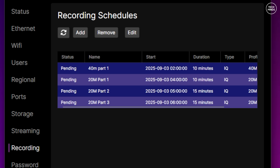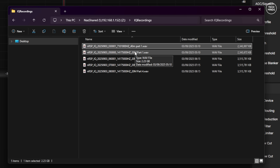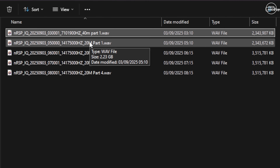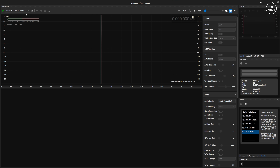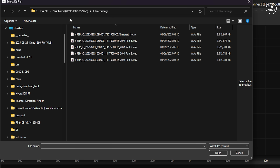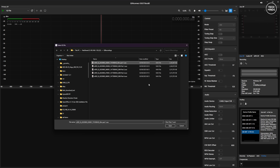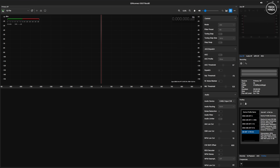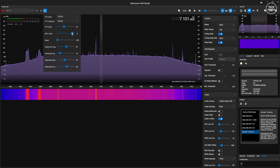Remembering I'll be turning off my computer — the only two devices left on are the nRSP receiver and the NAS. And here we are, navigating to the shared folder on my NAS from my Windows computer. We can see the IQ recordings made from those scheduled recordings. Now it's time to go through each one and see if we caught anything exciting. To play these back, you need SDR Connect — instead of choosing the nRSP as the source, you select File at the bottom, then open the file you wish to play and click the play button.